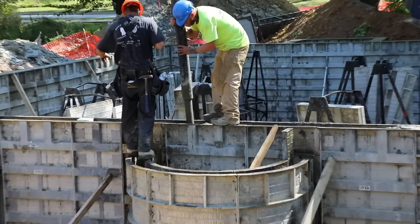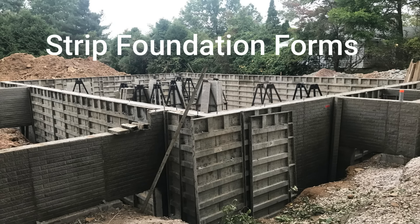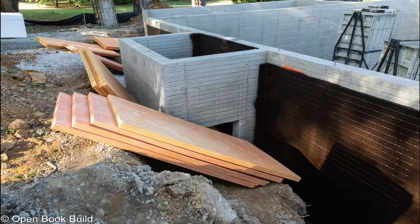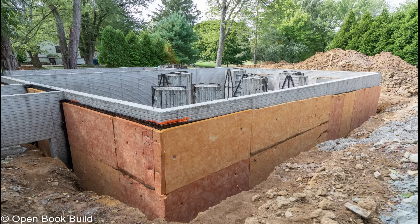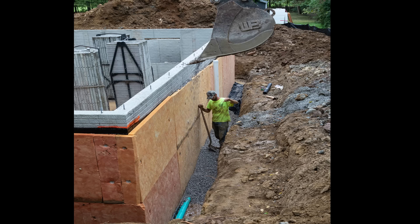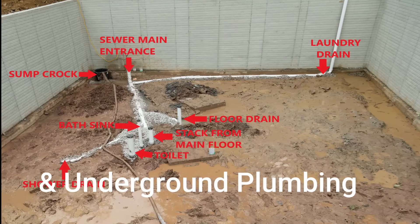Because we've got 75 degree temperatures we can strip the wall panels the very next day. Day twelve we're going to waterproof the foundation wall and then apply the two and three-eighths inch R10 insulation to the outside. Day thirteen we're going to install the drain tile around the outside perimeter of the basement wall. We're also going to install the under-slab plumbing for the basement.